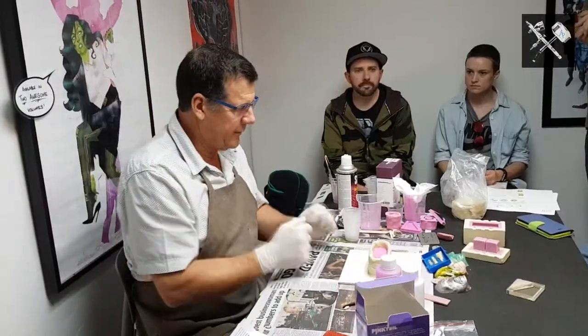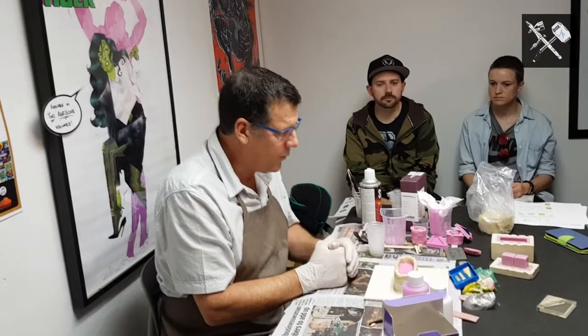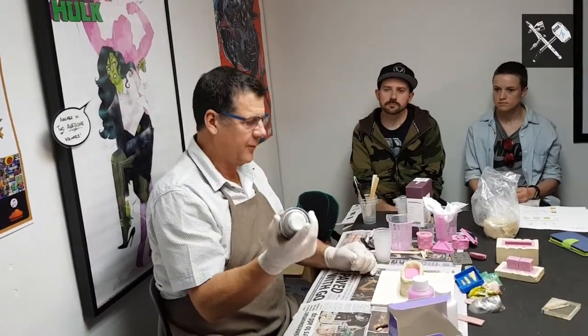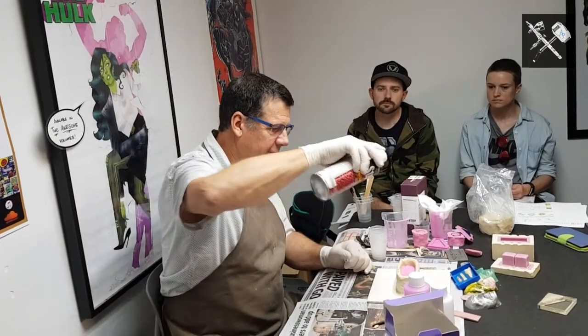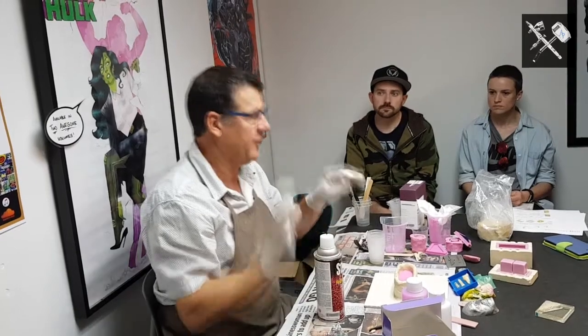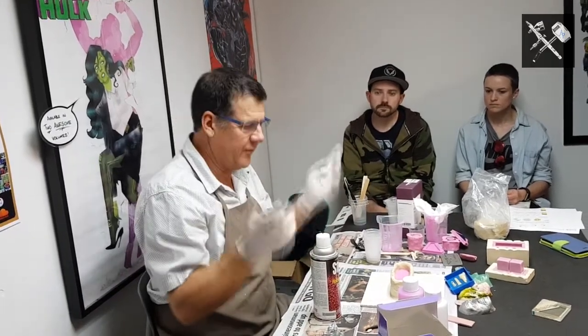Some people are a little bit anal on their moulds and want that to be perfect. So if you wanted to, you could use a bit of this rocket release, do a very light spray from a height. That'll break the surface tension when you very first poured it, and you'll see lots of bubbles come up. It's just a visual thing.